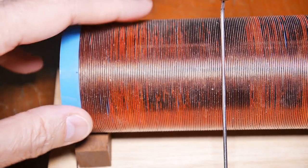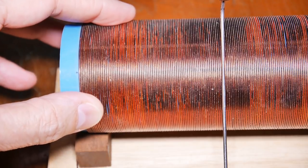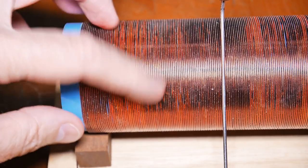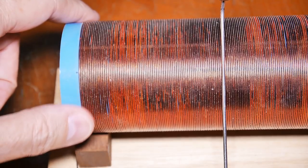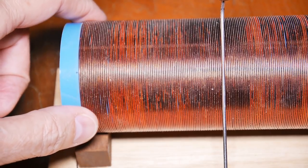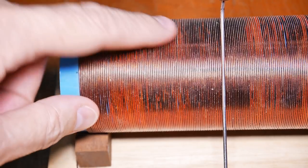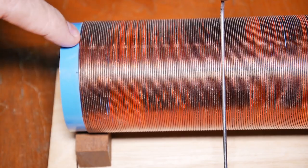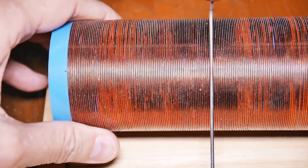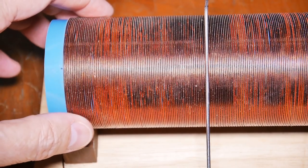The final absolute thing you can do wrong to keep your radio from working, and this one's not very common, I've only had one person ask me about it, but they got some wire and they wound their coil, and then they wrote to me and they said, well, what do you mean by enameled? I just have some bare copper wire. And okay, that will not work, because if it's bare copper wire, you'll just have a short all the way from one end of the coil to the other, and it's basically like a solid copper tube if you do that, and that just won't work. So